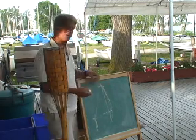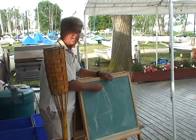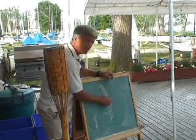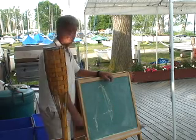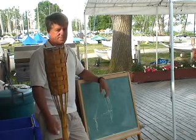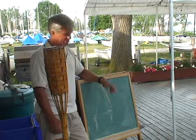But that's work. These guys are switching to using more vang sheeting than mainsheet tension. Because of that, in the mainsail we did for them, we actually flattened the sail a bit more at the top, because they're not sheeting as hard on the mainsheet, so their mast is bending more down low and not as much up high. These are all small sail-making things, and we're talking a few millimeters of difference in the shape of the sail, but it's something I saw in some of the videos that they took, so we try something different.